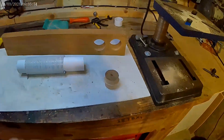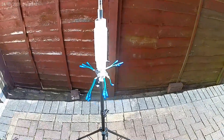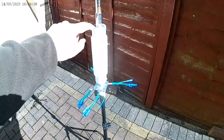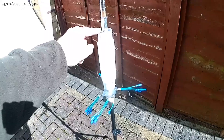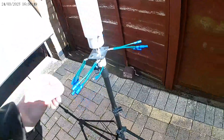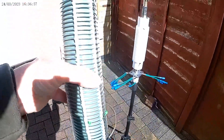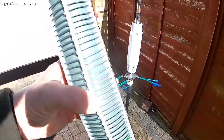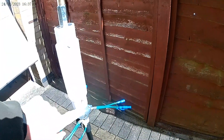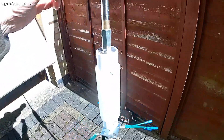So there we have the loading coil. I've made some bungs for the top and bottom out of solid hardwood. This is the new coil, and this is the old coil — it's got a discharge resistor for static. The old one works very well but just looks ugly. The new one will have a socket — either SO-239 or BNC — and this is not for permanent outdoor use, just for my portable aerial setup.